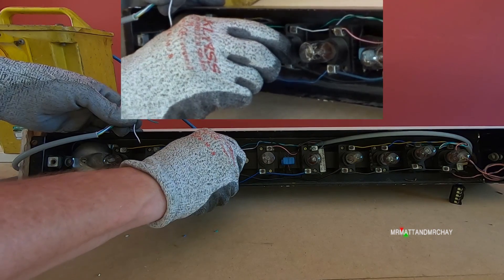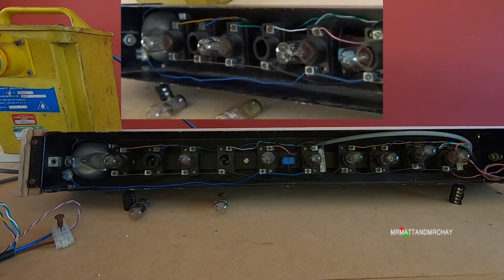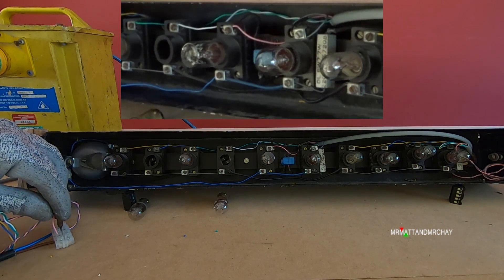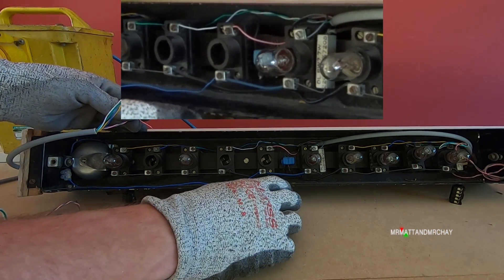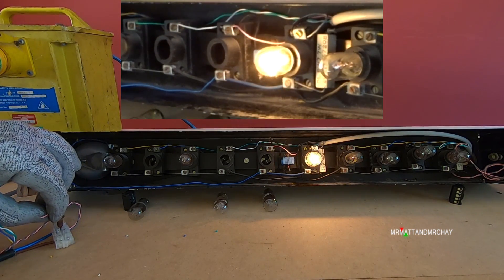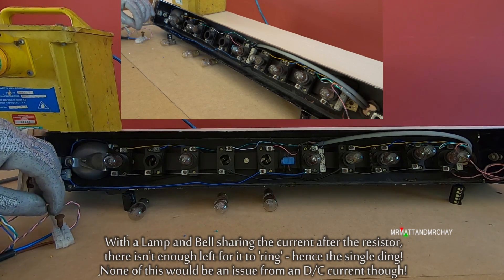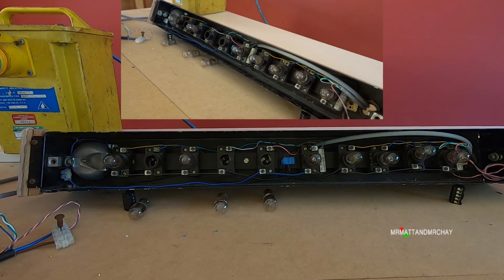Then I have the pink and slate wires. Now these are the up-down lamps and the bell. Don't forget, this will ring like an alarm rather than just a single ding. And the lamp doesn't work. Down - we'll do exactly the same thing, let's see if the lamp works or not. One ding. That's because of the resistor - so that resistor has stopped the current from running that bell continuously. There's an AC supply, so the bell is just trying to ring continuously - you can hear it trying to, but it just can't do it.